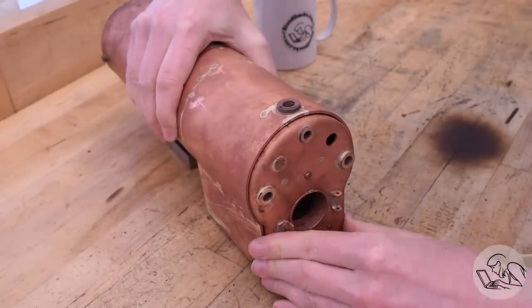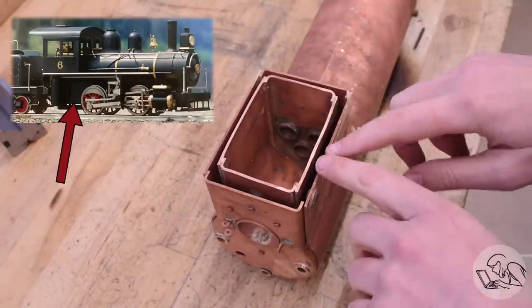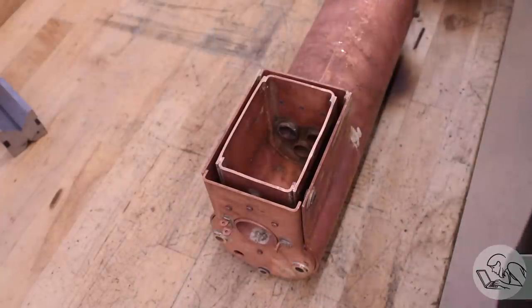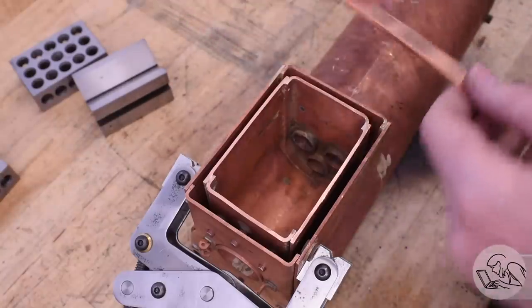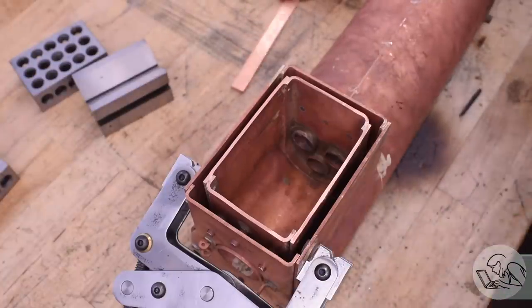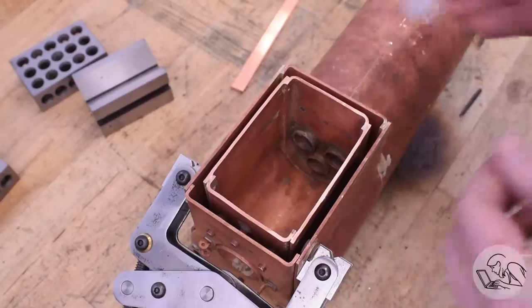The task at hand here is the foundation ring, or mud ring as some folks call it — because it drags in the mud I guess, I don't know why they call it that. But it's a ring that fills in this gap here to complete the double wall structure. As you can see it's a very complicated shape that we need to create. There are a lot of little nooks and crannies and curves where all of these pieces of sheet metal meet, and this fit has to be perfect or it isn't going to silver solder properly and it isn't going to seal.